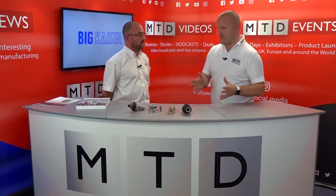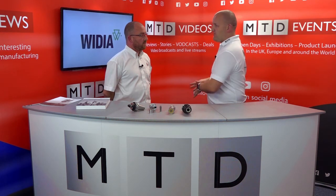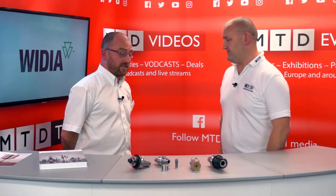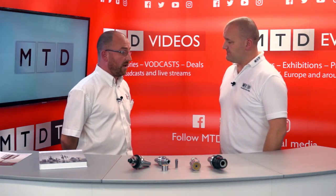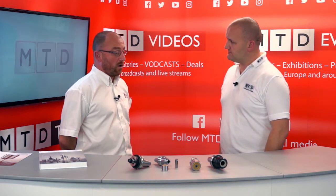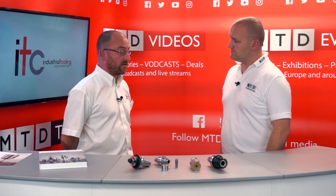So in conclusion from today, what sets you apart? Why are people going to buy these instead of the other 25, 30, 40 brands available? It's down to quality, it's down to contact, and it's down to run out. We will guarantee an improvement in the process, changing to either the Big Plus system or even just a standard BT, purely because we're that confident in the contact on the spindle.